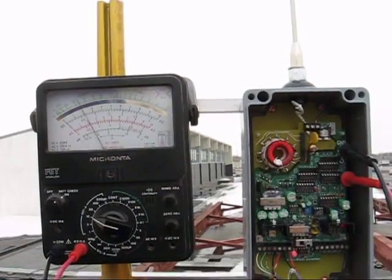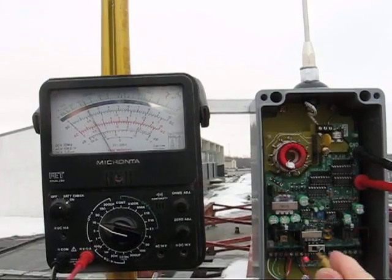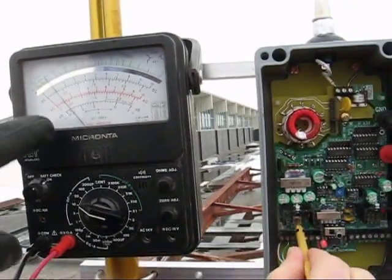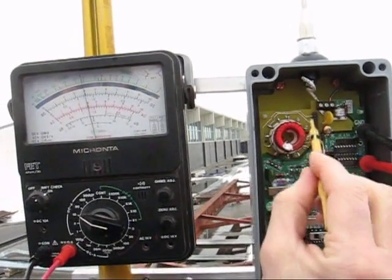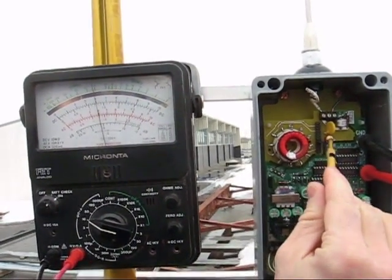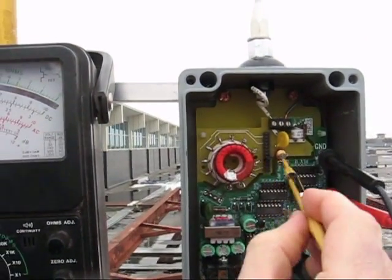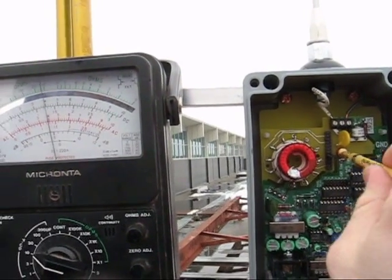Let's say this was the only transmitter. So what we're going to do: we've got power on, we've got the audio down. You want to adjust the power so that you can get a good middle reading here. With this pot, there are ten turns total, and what we're trying to do is get it right in the middle, which I have already done.